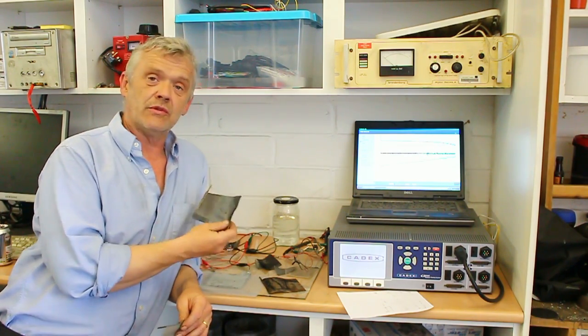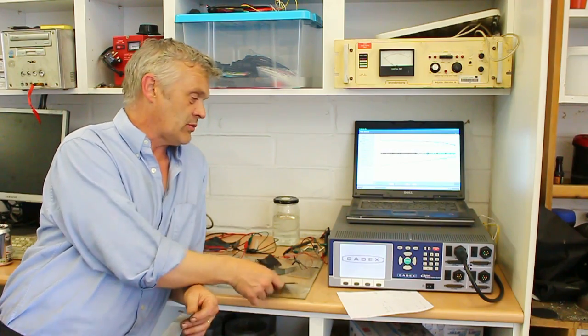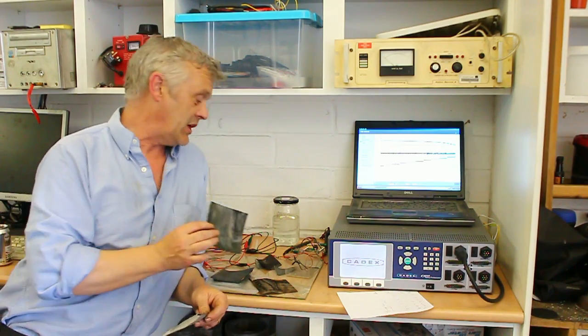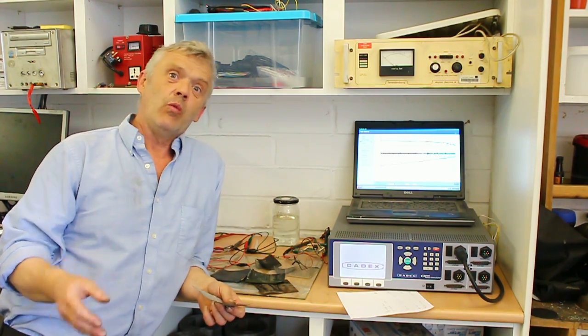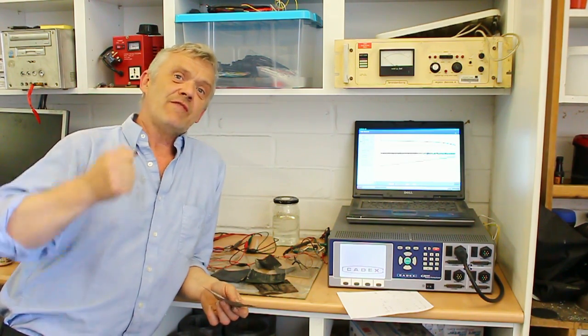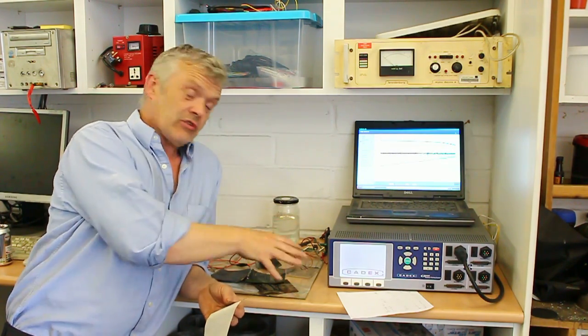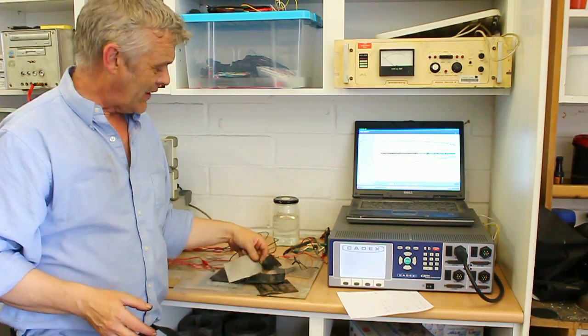It's a calibrated load from an industry standard machine, so we can quite happily state that between 1.8 and 0.4 volts, this device will show 258 watt hours per kilo. This device will show 126 watt hours per kilo, and this device will show 35 watt hours per kilo. And that we can be quite categoric about. What we need to do now, obviously, is get somebody who's an independent witness in to witness what we're doing and sign it off and say, hey, that's what I saw, that was independent, I verify the verification. So they will verify that all we actually did was use this machine to test those results and show you those results are in fact real.